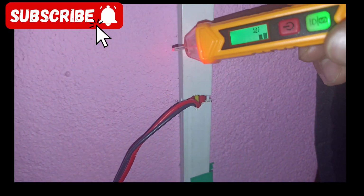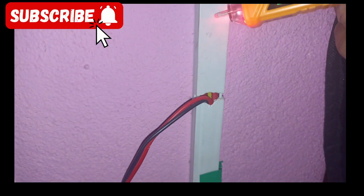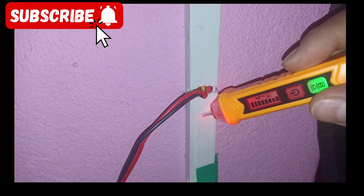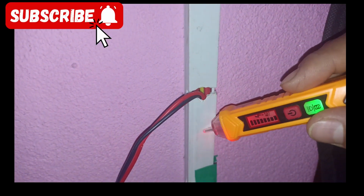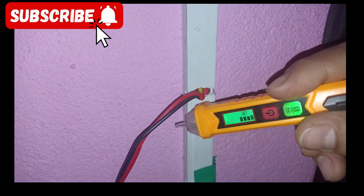If you want to find a breakage, you can use the high sensitivity mode and just hover over it. It will detect where the power line is broken. It will not light up. I will turn this sensitive mode off.